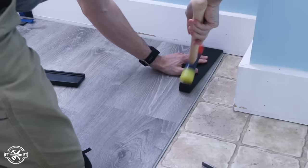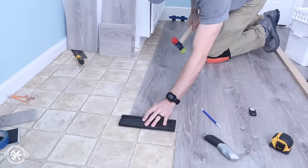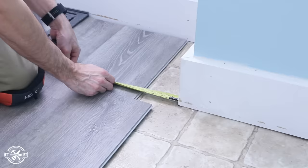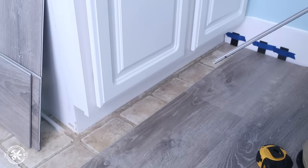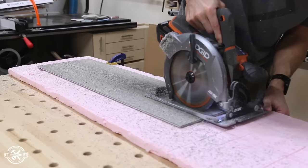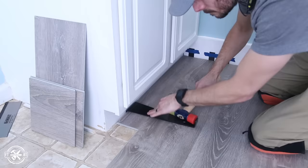I'm really staggering the seams of these planks randomly. You want to avoid a consistent spacing between seams like a brick-laid pattern because it won't look natural to the eye. When I got to the bump out on the other side of the room, I measured and marked the planks for the notch. That corner was way out of square so I measured at the beginning and end of each side. I made the angled cuts with my jigsaw and taking that extra time gave me a great fit. When I got back to the sink vanity you can see why I made that first row narrower — if I had started with a full-width plank, the sliver in front of the vanity would have been under 2 inches. I also planned the staggers so I didn't need to notch that narrow piece, just the next full-size plank. Planning these little details ahead of time makes your flooring install go much smoother and look a lot nicer.